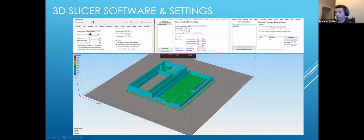So the layer height is essentially everything. How much detail you get is completely dependent on what your layer height is set to. So shorter layer heights, more detail, longer prints. I think I printed a very small container once that was about 1.5 inches, if that tall, but it was with a 0.2 millimeter nozzle. So the hole that the plastic was extruded from is only 0.2 millimeters in diameter. And we were printing with a layer height of, I think, 0.01 millimeters. It was like a micron per layer. So to print something 1.5 inches tall, it took like 11 hours. Now this, we're doing 0.2 millimeters. This only took about maybe 3.